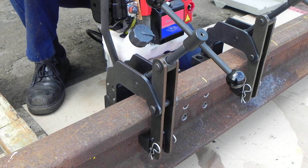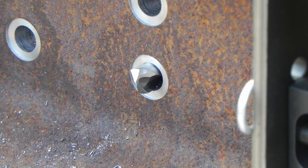Refit the drilling jig to the opposite side of the rail, aligning the centre lines as previously. Check that the drill enters the hole. If not, realign the drilling jig.